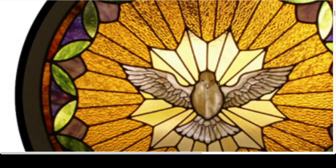Yeah, you put your pin right there. Because in the event that the pin itself will mar the outer area of this lead, it's not going to be an issue because you're under a solder joint. This lead here will butt up to this lead, and you'll never know that little indentation is there.